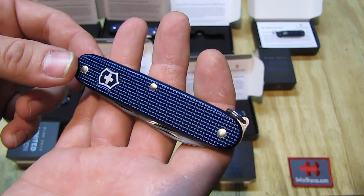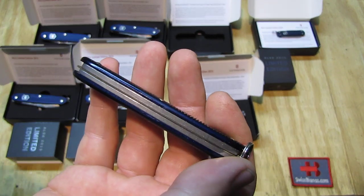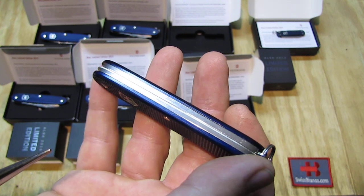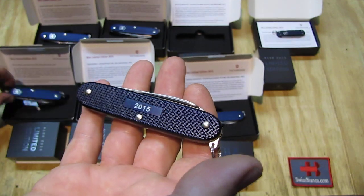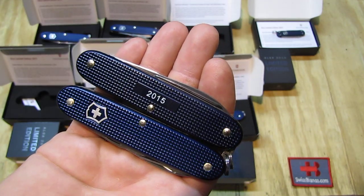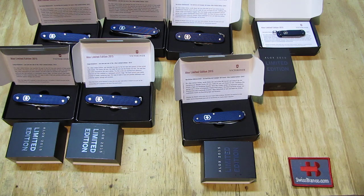That is the last one. Here we also see really well that the lower part has a lighter color than the top part. I hope the camera sees it. Sometimes it's hard to pick up, but the lower part here has a way lighter color than the top part. Maybe that one is gonna show it too. So they are not all the same. With aluminum, it's really a problem with anodizing. Best would be to anodize those in pairs. I do my own anodizing, so I have seen the problems for decades by now. So it's really not that easy.